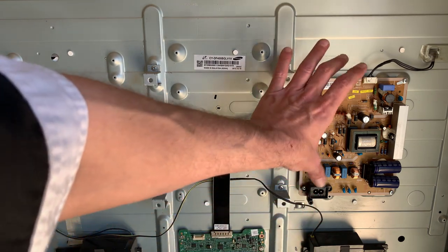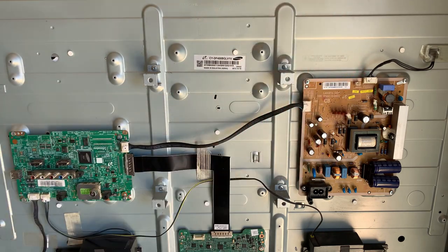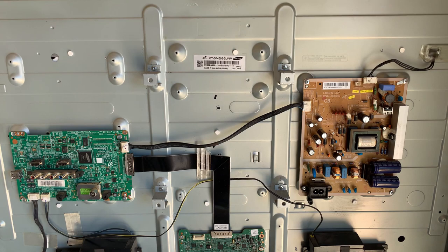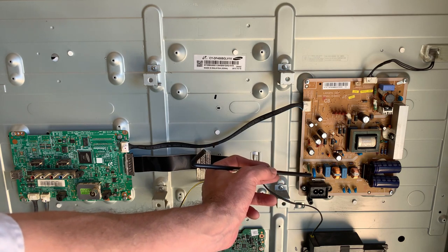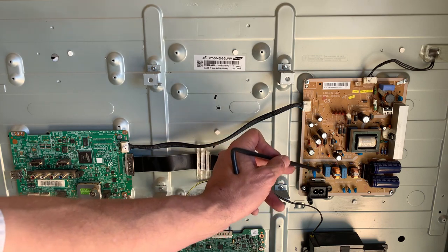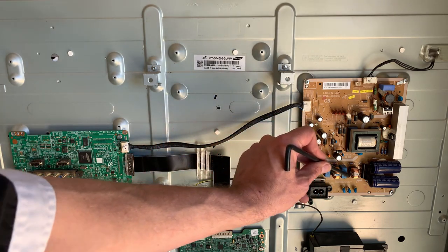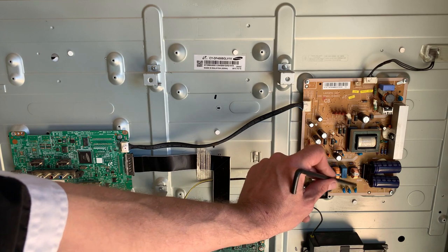But in our case, when we put the power on, it did its little startup thing and we heard the little jingle. So this part of the circuit, in other words, the AC is coming in down here, it's going through our fuse, it's going through a bunch of varistors, and looks like a nice NTC there, some common mode chokes. These big copper wound things are common mode chokes. It's filtering, some safety capacitors, again filtering, more surge protection, more MOVs.